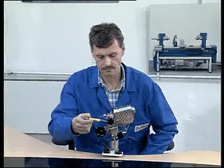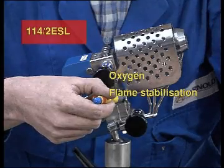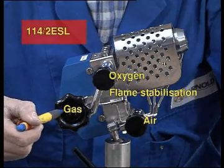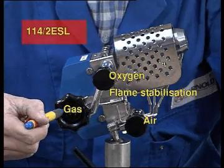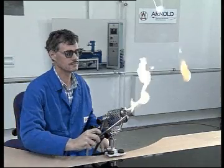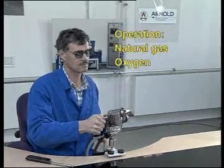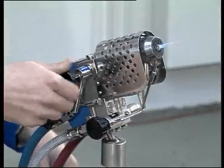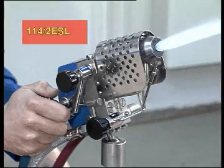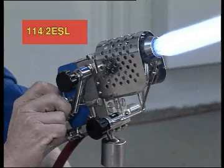The operating elements are: the oxygen valve, flame stabilization valve, air valve, and gas tap for regulating the flame. To ignite the burner, open the gas tap in the main line and ignite the escaping gas quickly and safely at the burner. To operate the burner with natural gas and oxygen, open the oxygen valve. Turning the gas tap adjusts the flame levels: pinpoint flame, medium flame, and intense flame.